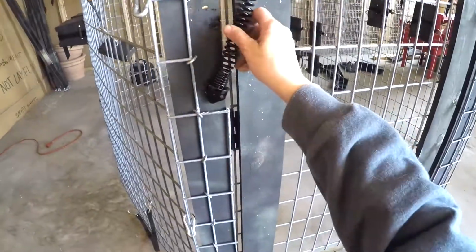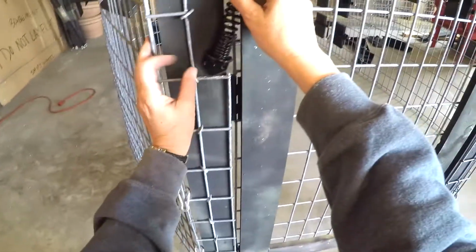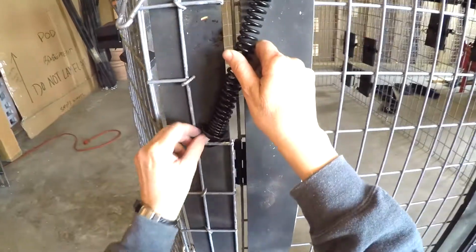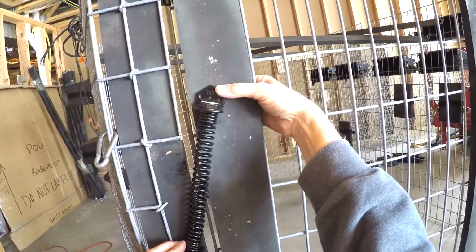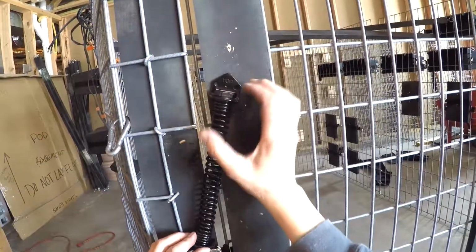So, the next thing we do then is attach our spring, and I'm going to turn this off while I open it up. All right, here is the spring, and it's going to go like this. Now when you read the instructions on the package, it says that you should try to get this spring as vertical as possible. So we're going to put it right up about in there. And I also know from doing a lot of these that if I slide it down under that bar right here, I will be less likely to hit something on the other side with the screws. So let's see. I'm feeling the back of it here. If I go right there, it won't hit that bar on the other side of the wood. The screw, I mean. So that's where I want to put it.